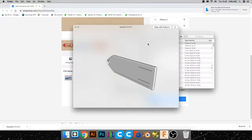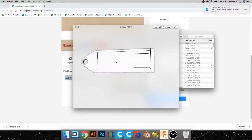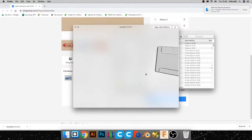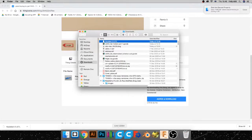What you need to look for is the Thing Files tab. For 3D printing, you'll mostly use STL files — click on that to download. On Mac, press spacebar to open a preview; on Windows you need a 3D preview program. A slicer is software that turns your 3D model into instructions for the 3D printer. It slices the model into layers and figures out how each layer should be drawn with plastic for each specific printer.